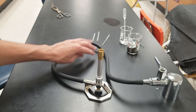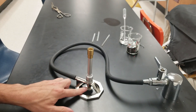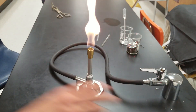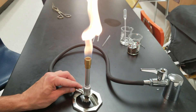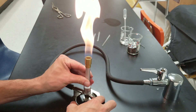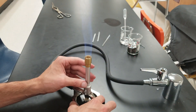Let's move that to where you can see it. I begin — the gas valve is open. I can open this gas valve, you'll hear it too — and strike, and that lights the gas burner. This is the color of an inefficient flame. In order to get the efficient flame, with the gas valve about as open as it is, let's now change the airflow by adding air — you'll notice the distinct change in color.